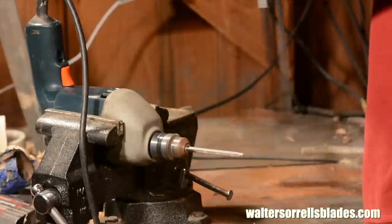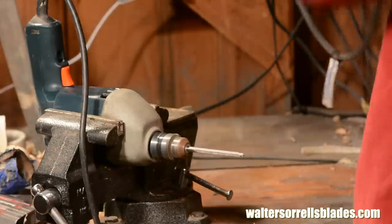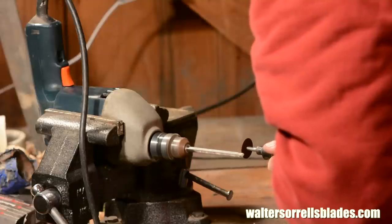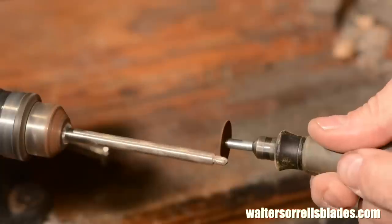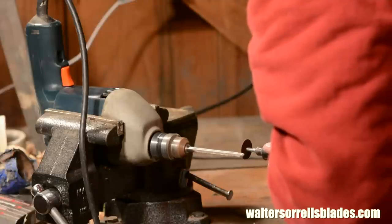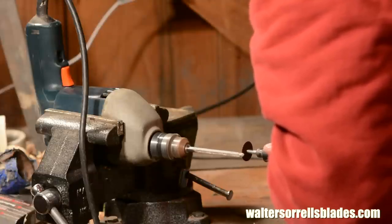Method 4, drill and Dremel. So, we mount the drill gently in our vise, making sure not to crush it. Then, using a cutoff wheel on our Dremel, we cut a beautiful, clean, perpendicular shelf. We'll also sort of scrape our way up and down the shaft at a lesser diameter. So we've solved the shelf, we've solved concentricity, but parallelism and consistency, not so much.